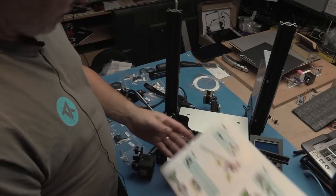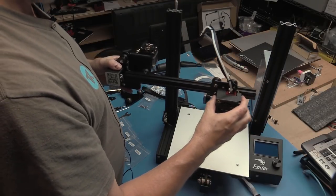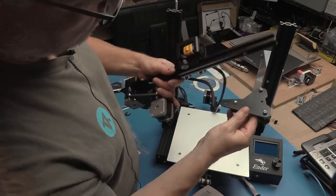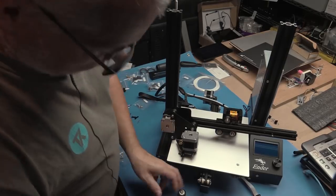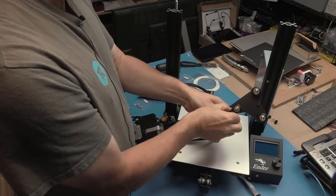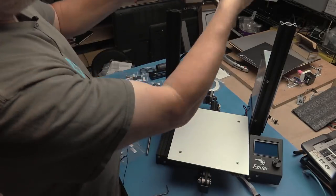On and the left hand plate on. So gantry, which is, sorry, the head carriage, which is this one. So this is going to go that way. So the head carriage has to go like this. And we'll just slide in there. It's nice, it's already pre-adjusted by the feel of it. So far, relatively easy, certainly within the realms of any, let's just say, novice kit builder. That in.